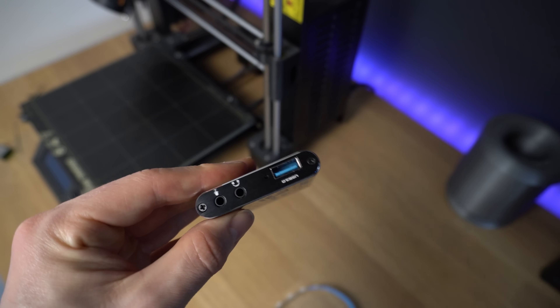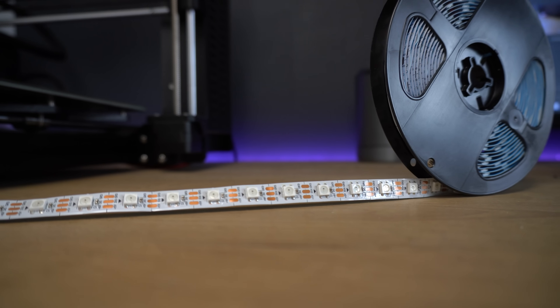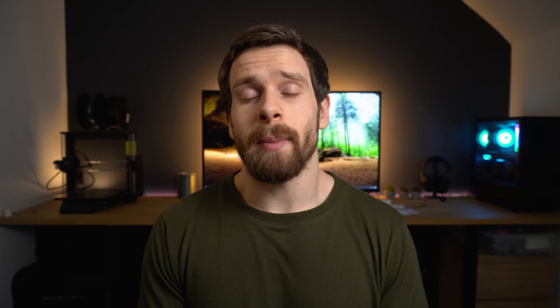I finally found a capture card on Amazon that ticked all of those boxes. It's a bit more expensive at $59.99, but if 4K HDR isn't important to you, you can definitely find ones that will do this exact job for less than half the price. I'll have links for everything you need in the description below. The LED strip I used was the classic WS2812B which runs at 5 volts — ideal for pairing with the Pi which also runs at 5 volts, meaning I can use one power supply to power both the Pi and the LED strip with no voltage step-down needed. The LED strip I have is 60 LEDs per metre, which I think is the sweet spot between brightness and power consumption.